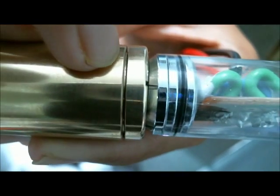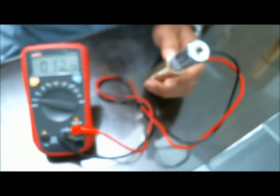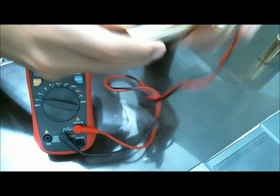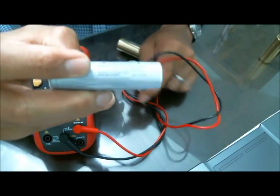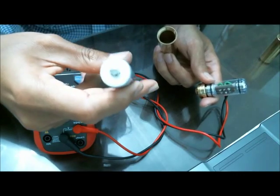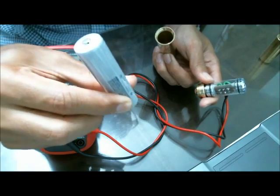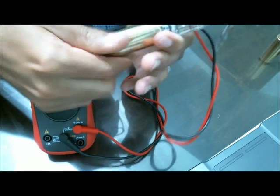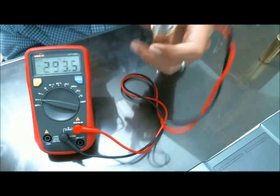And here comes problem number 2. When I put in the battery and screw it in, you can see there's a gap over here. Let me try to get this closer. See that gap? This gap right here? Yep. So that means the tube is actually a bit short for this type of battery. And this battery that I use is actually the Panasonic CGR18650, and these are becoming the standard sizes nowadays. The AW IMR is a standard, and probably the other famous one is the Efest or the Mnke brand. So we'll talk about that in a later section, but let's just get this done with.